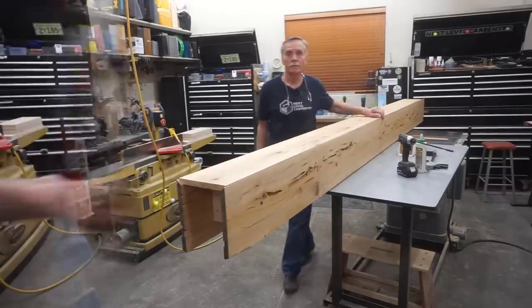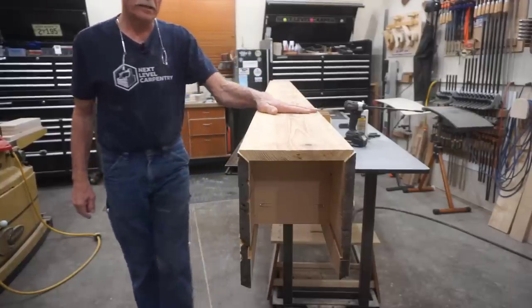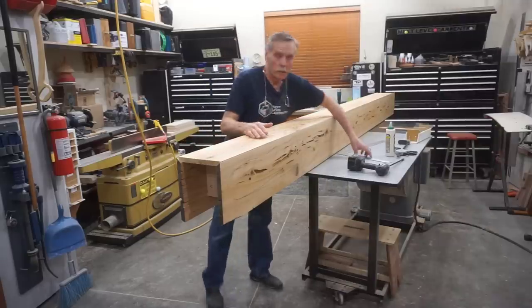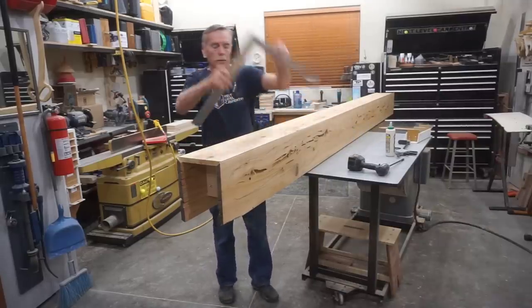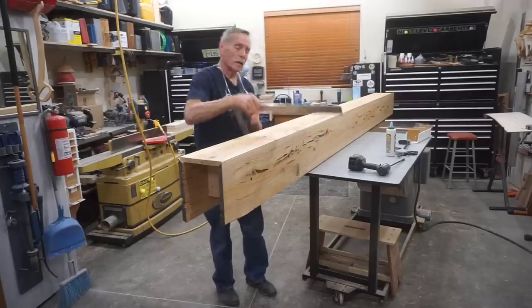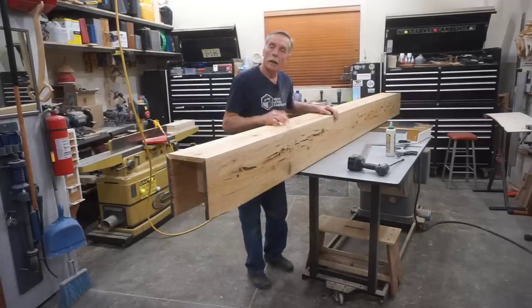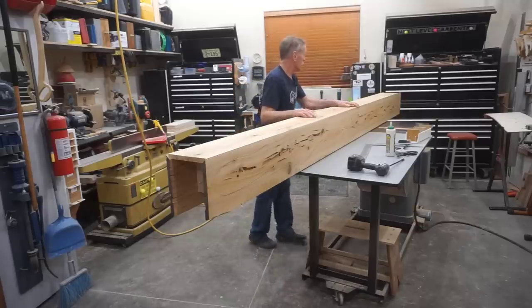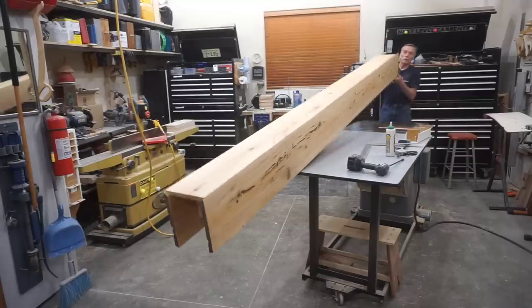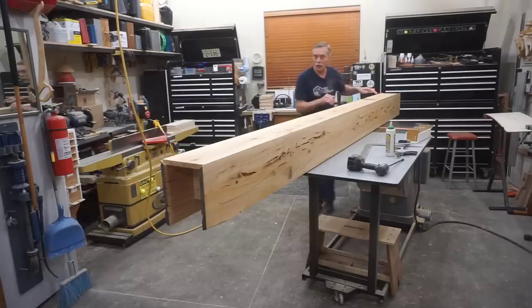that's a done deal. From this angle on the end, you can see that that beam is arrow straight from one end to the other, and not a single clamp is required. And not only is the beam straight and true, it's square to its corners because those blocks inside are what set the squareness of the beam, so there's no twist in it. And even though this is just dry fit with screws, no glue, this is just rigid, stiff as can be, and stays straight like that.